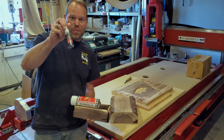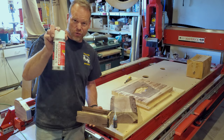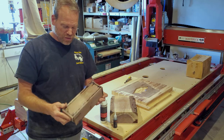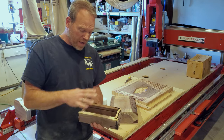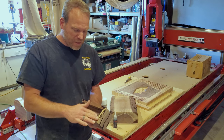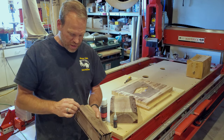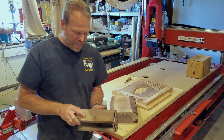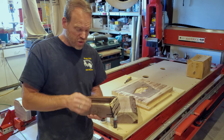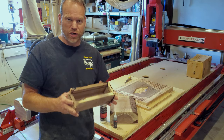This is medium black and the Starbond accelerator, and I went to town on this box. I actually built the box, got it dry, went through and filled in all the cracks, gaps, splits, and checking. Now I'm going to chisel it down, get the big chunks off, then sand it down for a little bit more refining work on it and we'll see how it turns out.